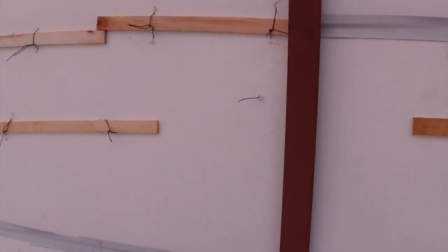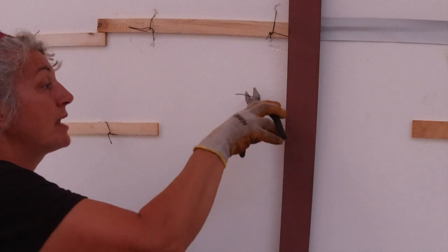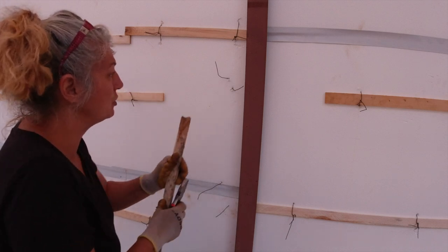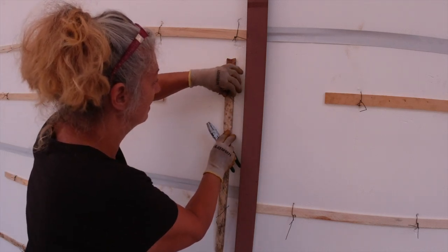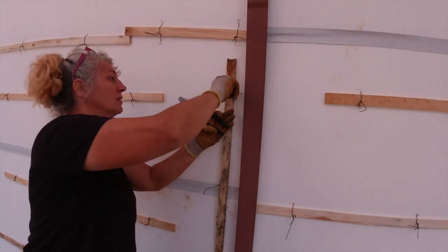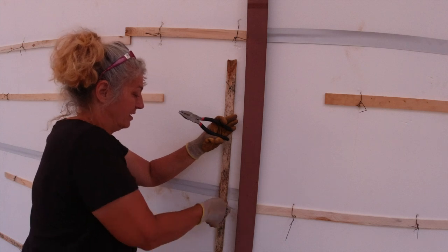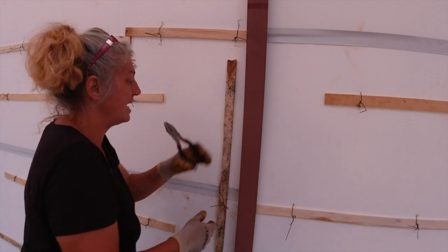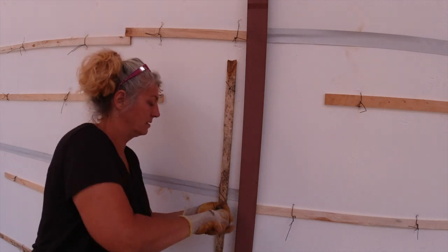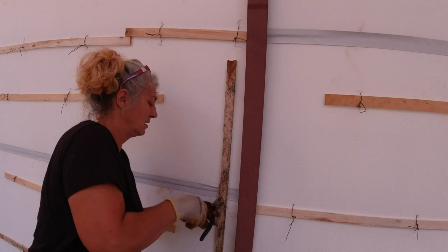So there's a wire. And I'll pull it all the way through. It's around the rebar on the outside. That's a vertical? You don't need any more wire, just those two pieces are good. All right, hang on, don't snug them up too much. I'm just giving them a hand twist for now. And then I'll tighten them when you tell me. All right, tighten? A little bit. I'm doing the bottom one first. Tell me when. Another half a twist.